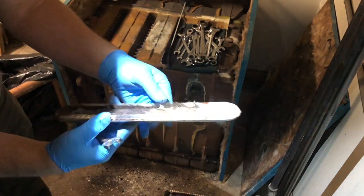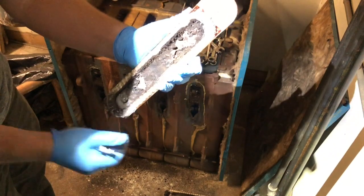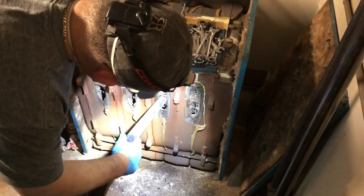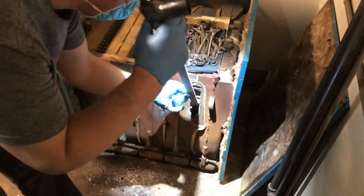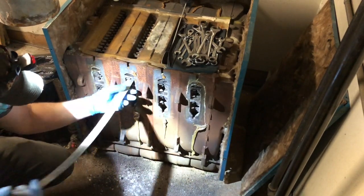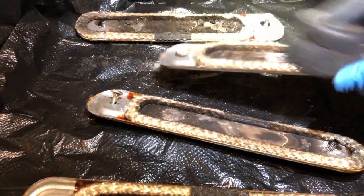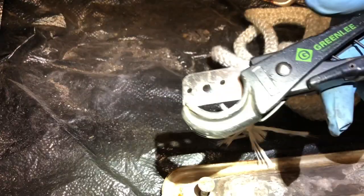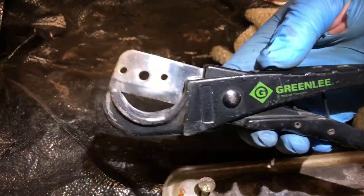Here's a close-up look. What we have here is a cover plate — it's directional, it has an up arrow, so make sure that goes at the top. Then you've got a rope gasket that seals the combustion. Watch out for the target wall in here because this is the back of the boiler — you don't want to damage that. I'm using a Greenlee PVC cutter — I use this to cut PEX — and it also works very well on this rope gasket. I'll put a link in the description below.